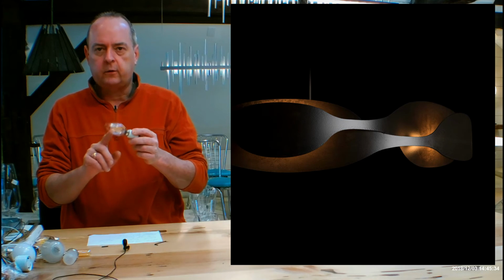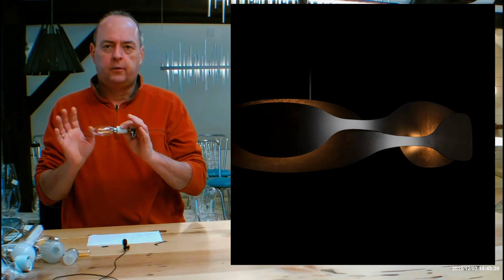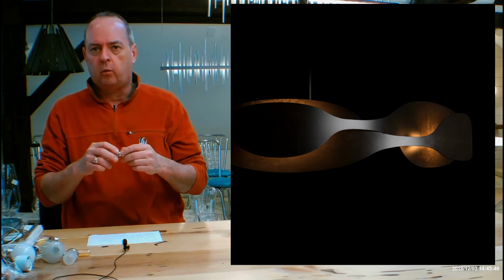The other thing about this is you can choose your color temperature. 2700 Kelvin is going to be the warmer light. Actually, they're even saying 3,000 Kelvin is a warmer light now too. However, anything beyond that, 4,000, 5,000 is going to be that whiter daylight.